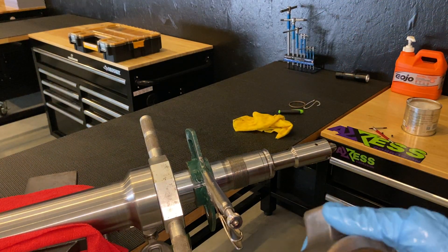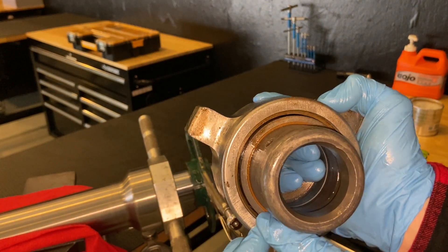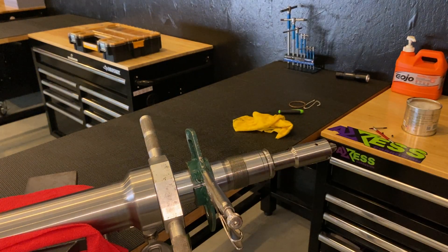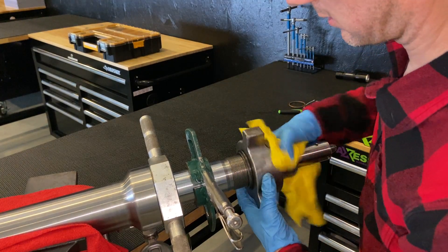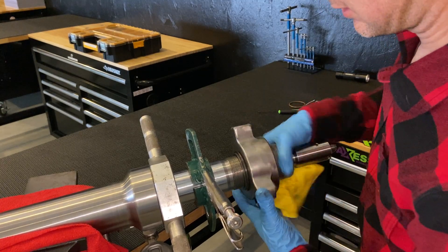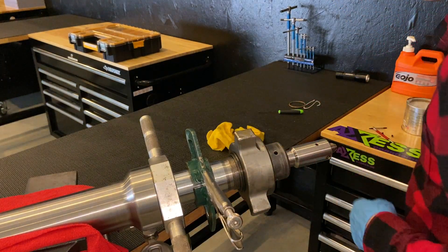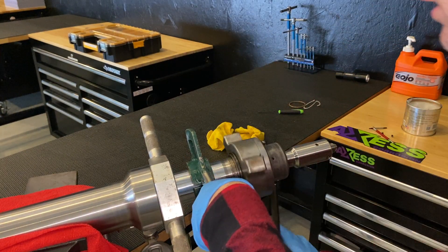There is another o-ring which is changed out more routinely — that's the one on the face side, which seals with the top of the valve. It's important to check that before every retrieval, before any time you take the tool and put it back on. When you're screwing it on, when it starts to get a little stiffer, that's that o-ring sitting onto the sealing surface and just taking up that space. At that point, just use your C-spanner to tighten it on — it should go nice and easy.